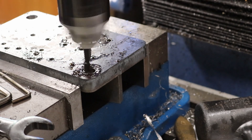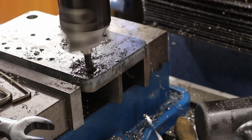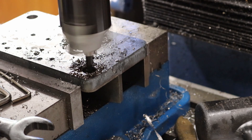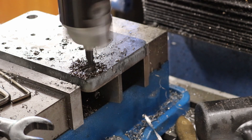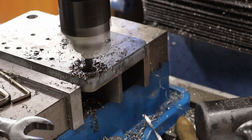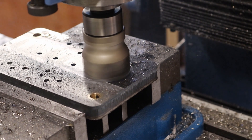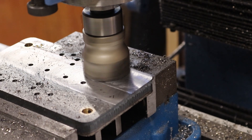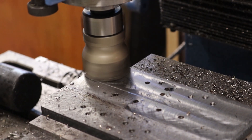The holes being bored for bushings is where I really went wrong with this project. I went too hard and too fast with the boring bar and managed to make a pretty poor surface finish in the hole, but that's not the biggest problem. The biggest problem was that the holes weren't perfectly aligned with the lower plate. I'm not sure if it was deflection or if my DRO scales skipped a bit, but it was enough that I had to recut the lower holes slightly to align. I should have taken more time and care, and I also should have skimmed these plates — top and bottom — before machining any features, because this plate was about 0.3mm thickness difference from side to side. The machine still worked in the end, but next time I'll definitely try and do better.